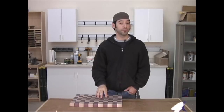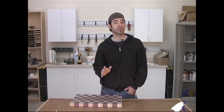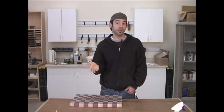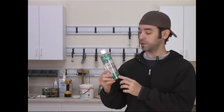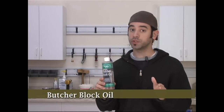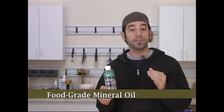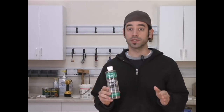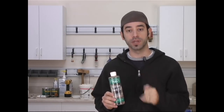Now it's time to talk a little bit about finishing. There are a number of ways that you could finish a cutting board, and there's a few things to avoid too. Now if you do a little research, you'll find a lot of conflicting opinions, and truthfully none of them are really wrong — you just need to decide which is best for you. I'll demonstrate the most popular methods. First, there's mineral oil. You may see this stuff sold as butcher block oil, but please don't waste your money — just go to your local supermarket or pharmacy and pick up some food grade mineral oil. It's odorless, it's tasteless, and it does a great job of repelling moisture. It's also an easy finish to renew whenever the board needs it.